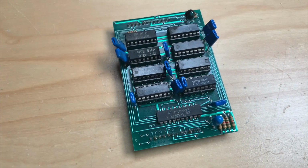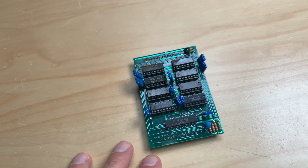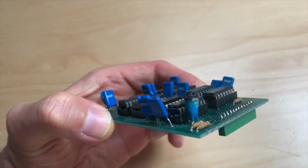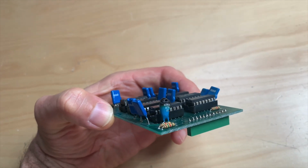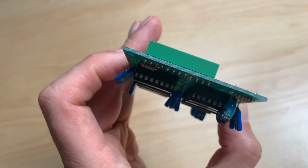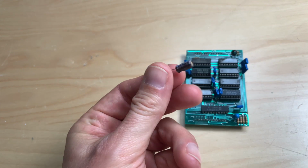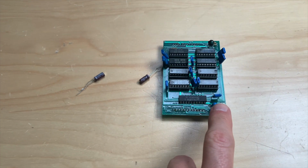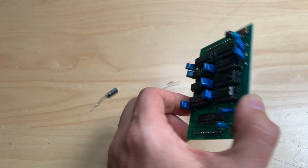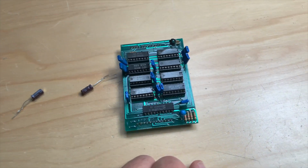Remember this little memory board that was inside the machine? Well, when I switched on the machine to show to my son, it just gave a bang and a lot of smoke, and that cap burnt down. Took me a while to find it. And this is a 100 microfarad 6.3 volts, which is printed upside down. I'm going to replace this with standard caps because there's one here which I don't want to blow up in my face, and here. And then I hope that machine is good to go again. And maybe that is also the reason for the flaky picture. So we will see about that.